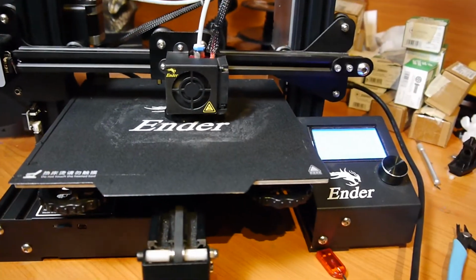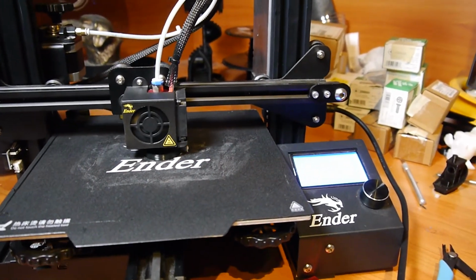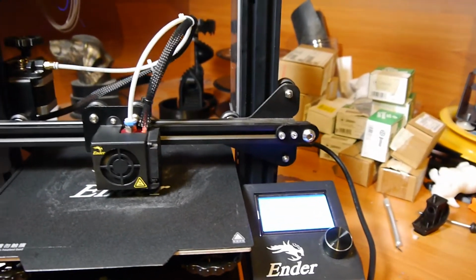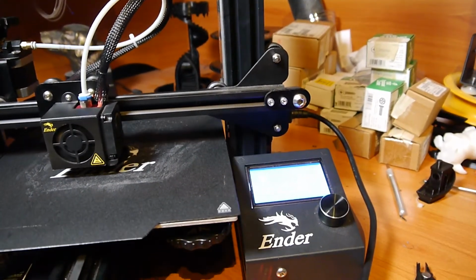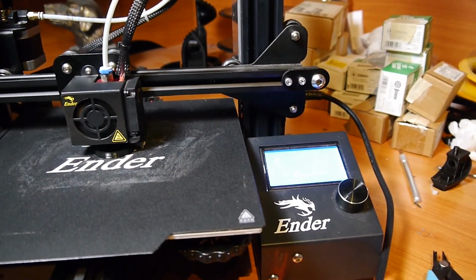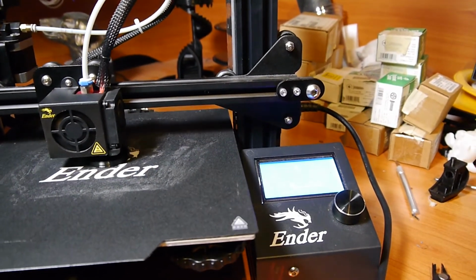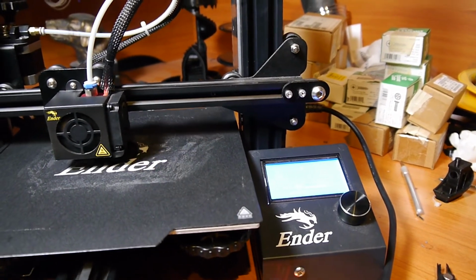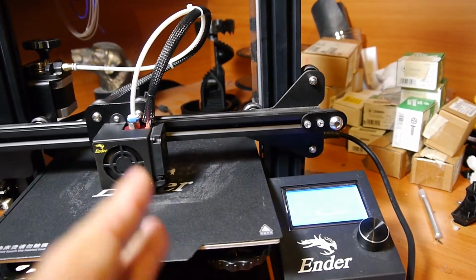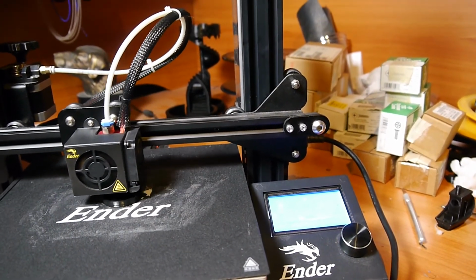All right, well, I'm running off a test print. It looks like it's running fine now. I took a second look at it after I stepped away and got it off my mind for a little while, but I discovered, because it was saying there was the thermals or the hot end problems, all that good stuff, and shutting off. So I got underneath and looked again, and sure enough, I had the thermistors reversed. I had them between the bed and the hot end, so I just reversed them, and bingo, it worked fine.